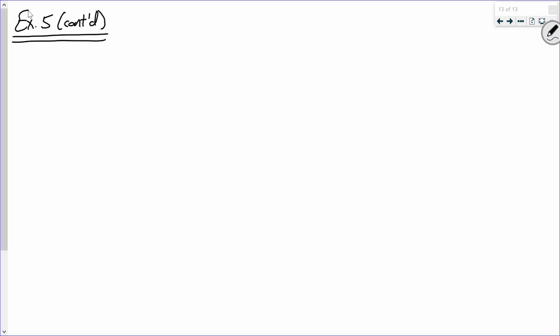Okay. So let's start off by looking at our strains. Let's recall a couple things. What was a for that last example? 4.182. Okay. Now, that's a. Now let me ask you this. What is beta 1 going to be? That's going to make y'all do some digging. So what is beta 1 going to be? 0.85. And why are you saying that? It's the f'c. Exactly right.